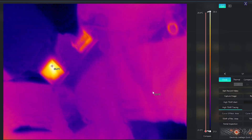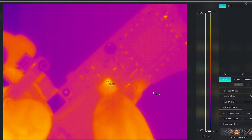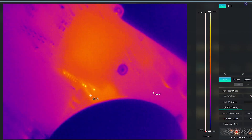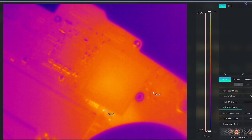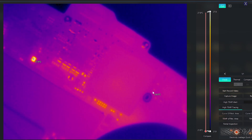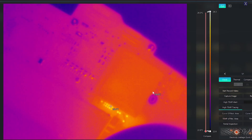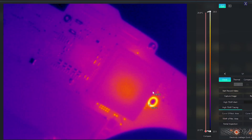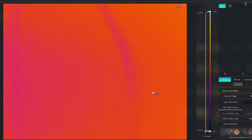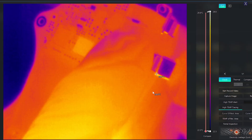When you take voltage in, the board should show some warmth. If there's a bad component, the thermal camera may give a better idea of where something might be located. When you plug it in, you'll always get these components get a little bit excited — those are your CD32s. This is the T2 area, and that could be a problem too. The T2 is your security chip, and it's normal for it to come on and power on if it shows a good flow. We can see one CD32 getting warm, which is part of the USB-C circuit.